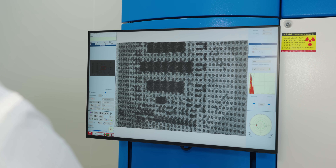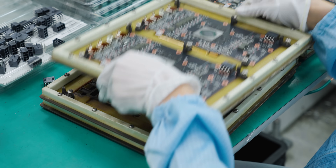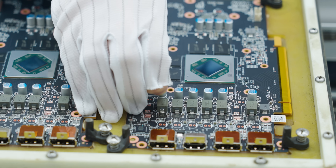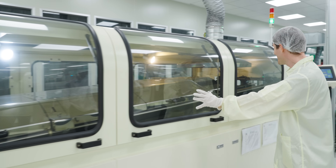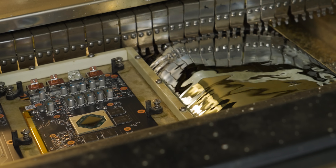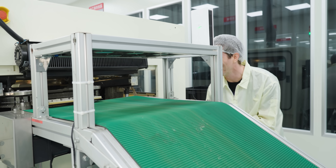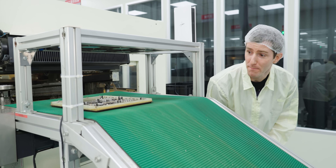At the first station, each jig gets two GPUs and the 8-pin PCIe power connectors, then the fan header, followed by capacitors — and more capacitors — and finally more capacitors. The backside of the board gets sprayed with flux, then goes through the oven again. At the end, the back of the board runs across a liquid solder waterfall to solder all the through-board components.